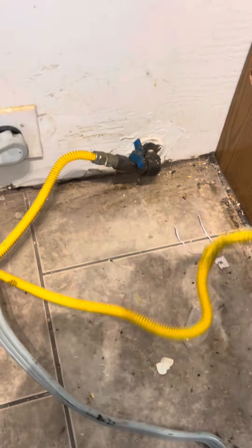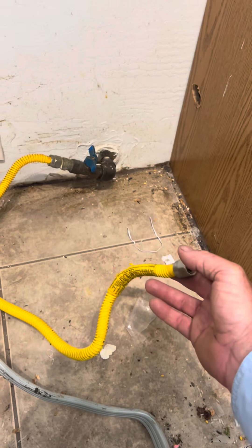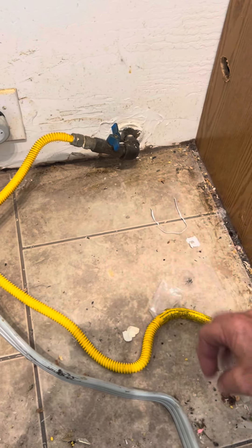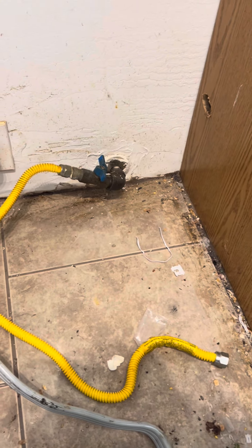As far as this house is concerned, I am definitely going to recommend putting gas safety caps on here, especially so that when we push the oven back into place it doesn't hit the shutoff valve, open the valve, and spill gas into the home. Be safe out there, have a great day, and God bless.